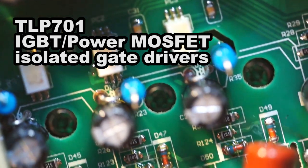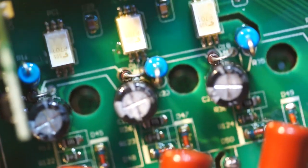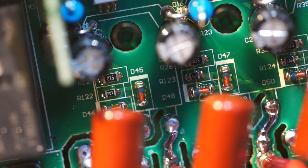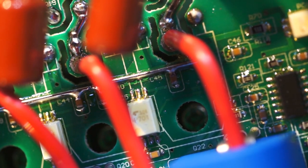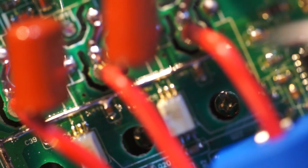And each one of them has what looks to be a half-watt resistor and a diode on the output, and then there's a capacitor, some surface mount passives. These ones don't have similar circuitry, though we do have some less than great layout practice.